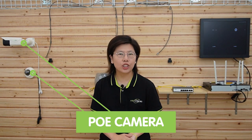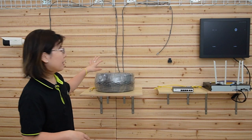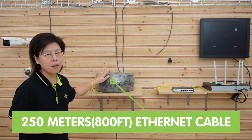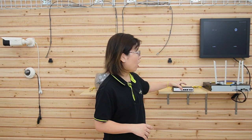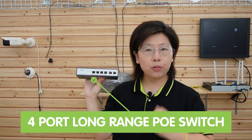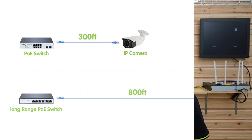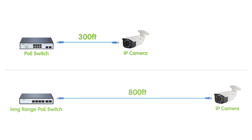As you can see, today we are going to connect two IP cameras at the edge. Just like our customer's case, he is adding two IP cameras in his farm using a single CAT6 Ethernet cable. That's why we are using this 250-meter — that's about 800-foot — CAT6 Ethernet cable in between, with this 4-port long-range PoE switch. This switch has a PoE power extender feature to bring the maximum PoE distance for IP cameras, requiring a continuous Ethernet run of 800 feet without any devices in between.